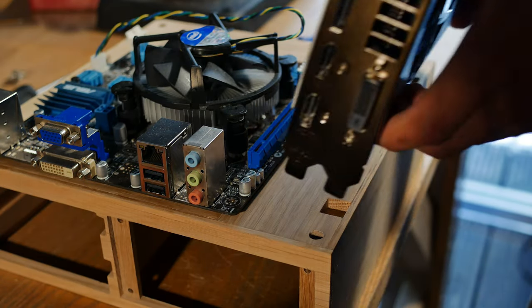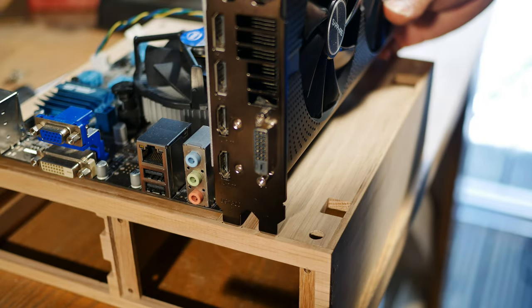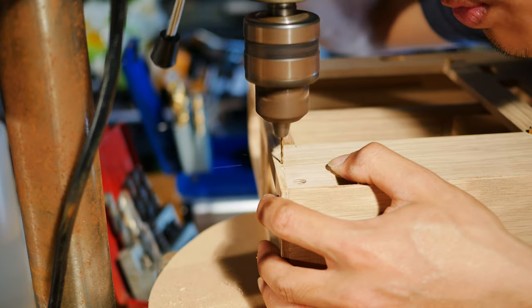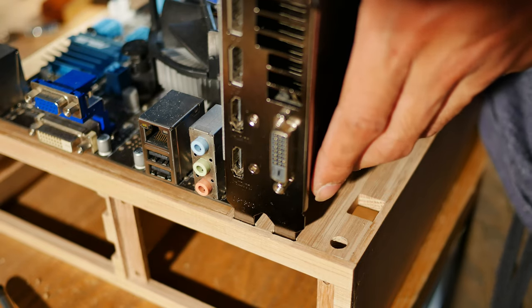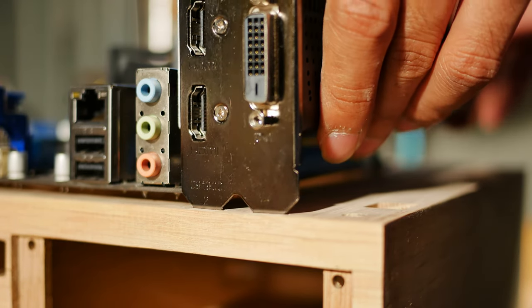Yet another oversight are the slots for the graphics card. An awkward sense of deja vu envelops me, as what we have to do has somehow been done before. Regardless, I've taken a 1.5mm bit and repeatedly drilled blind holes across the required markings. Yes, there's an attempt to chisel out something 1.5mm wide. This ain't working, Chief. Last resort is to completely drill through, making everything easier at the expense of these popping up on the other side. They're ugly, but I simply have to accept it.